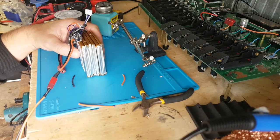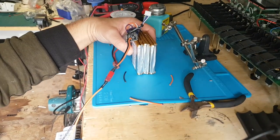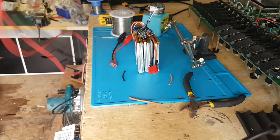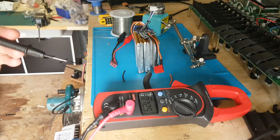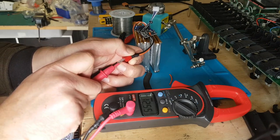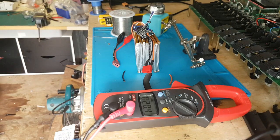I'm getting 620 milliamps - that's in the milliamps and it's dropping. Now it's getting power to it. Let's unplug it and see if we get some voltage back out now - it's 12.5655 volts. So basically what you've got to do the first time you use these is plug into the charger to initialize it, then it works. First time I did this I thought my BMS was faulty because it wasn't getting any voltage out, but it works fine. I'm just going to plug it into the Bose speaker. I haven't put the Kapton tape on yet - if I've got something wrong I don't want to break it.